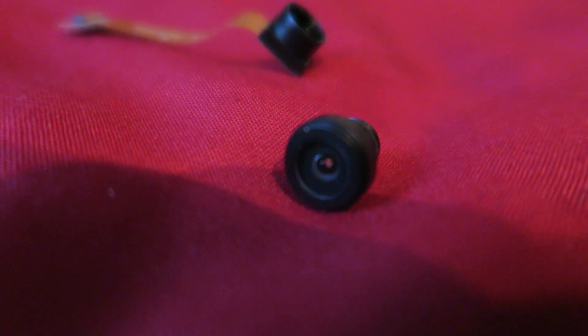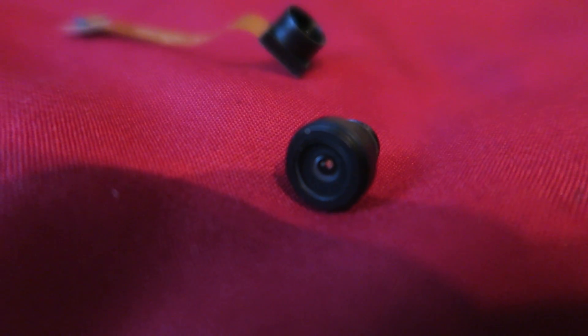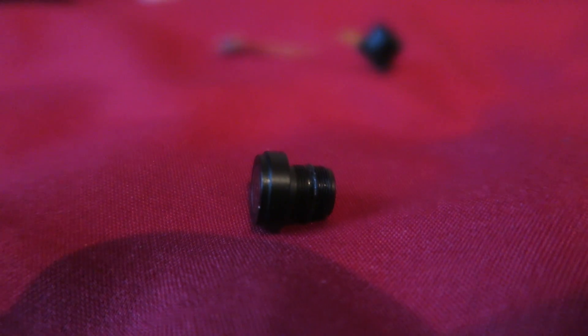The stock lens is glued into the housing. I removed the ribbon from the quad and then twisted the lens housing with quite a bit of force, which loosened the glue. Eventually the lens started to twist out. I removed every trace of the glue on the thread of the lens — this is important. If you don't do that, the lens will only screw in as far as it did previously and we will still have a blurry image.